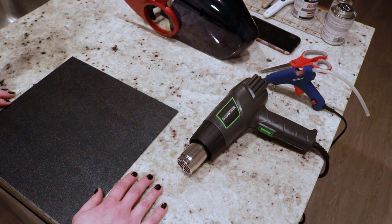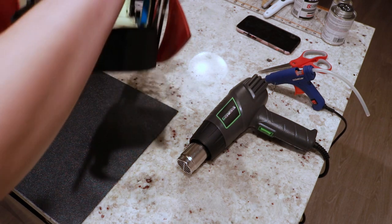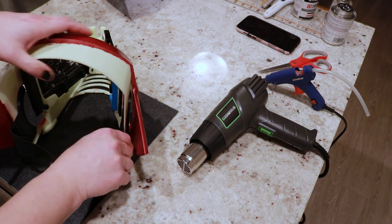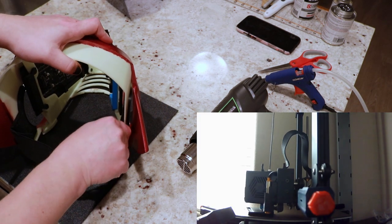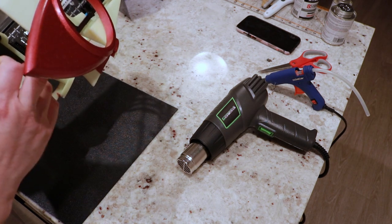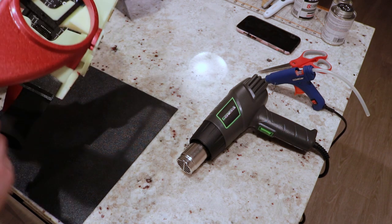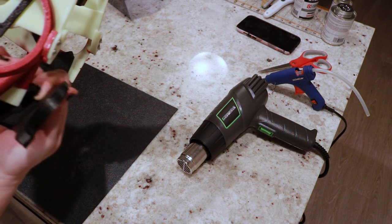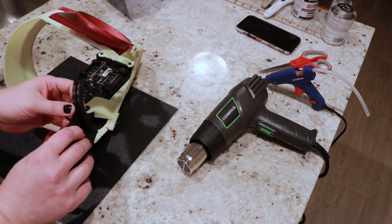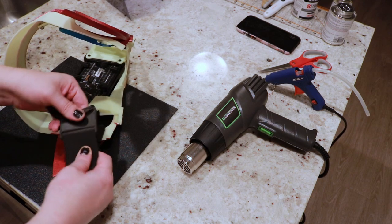The primary problem is I finally got to a point where the head was wearable. I spent a good amount of time on that week making these little adapter brackets to hold the elastic strap on - and they just pop out. So this is one of the brackets that fits in the circular portion of the inner part of the frame, not the outer cheek here because that's going to get covered, but the circle is replicated on an inner portion here. I designed a part that would fit in there and hold around that piece, with a place to put the elastic strap on.